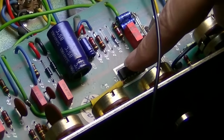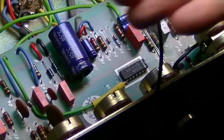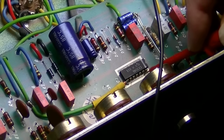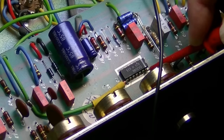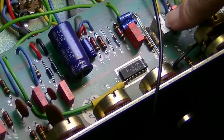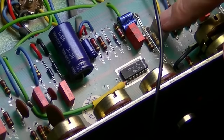All right, here's the integrated circuit, and it will actually be flipped upside down from what we're seeing on the schematic, because usually they're showing it from the bottom, so the pin we need is actually over here. And it's showing 0.22 microfarads, so we are getting the correct value out of this component, which is the capacitor that we were measuring. So that component's good.